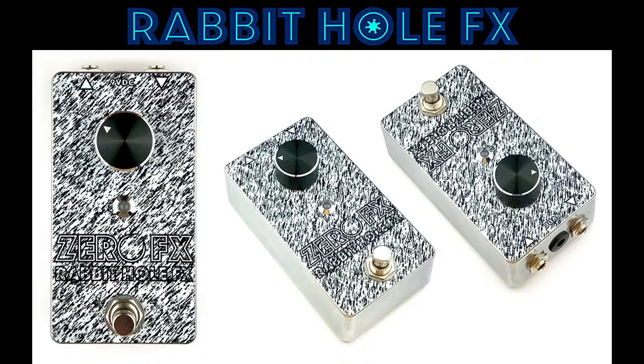Also, for live situations, I pretty often have the situation where an acoustic guitar plays on stage, with heavy strokers, and the guitar is a pretty high output. So the DI box, if I remember, on active DI boxes, they often distort. And you can't do anything with it at front of house, but you have this distorted sound and clipping. So you put this pedal in it, turn it down a little, and you're all good to go.